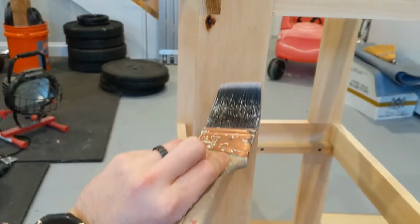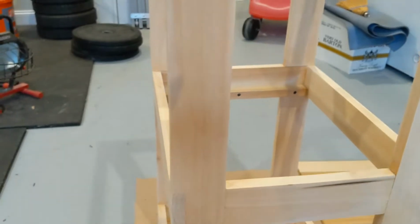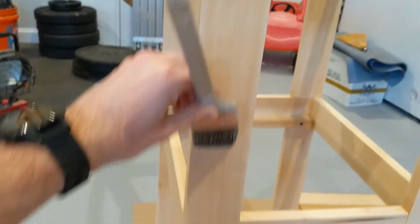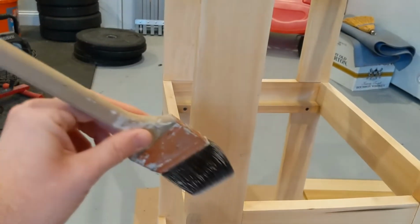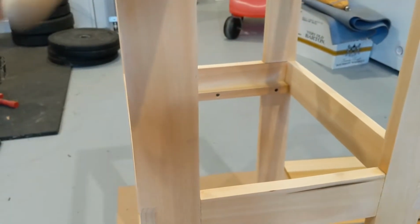And you can tell with the brush when I go up and down, it's rough. When you get enough on there to where it's not bleeding down your wood, you'll notice you get a much smoother stroke, and it feels like it's gliding across your wood rather than filling the crevices that might be left over in your grain. It gets even smoother as you go with more layers, which makes sense. You've got a thicker layer of polycrylic on there versus the wood grain. That's when you know you've got a good coat on there, when that brush runs a lot smoother in that grain direction.